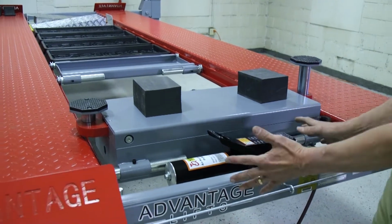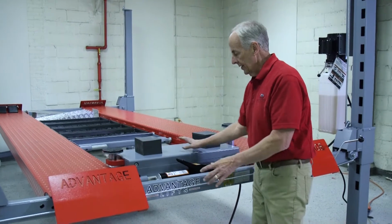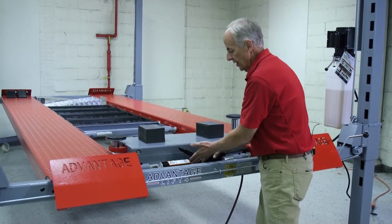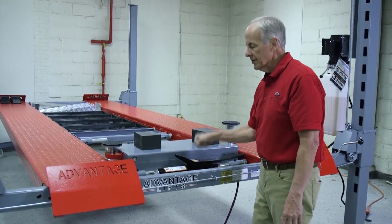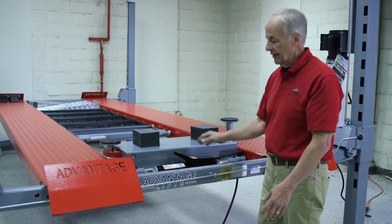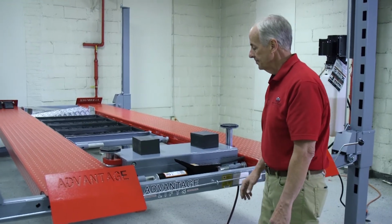Now, that is our air hydraulic jack. We also have a manual pump. It's the exact same jack, but we replaced this portion of it, and it's a hand pump. It's red in color, and so you would manually just pump like a Porta Power, and that's going to raise the jack up manually instead of using an air assist. That is the only difference between the 2 jacks.